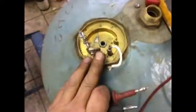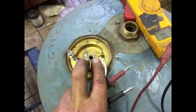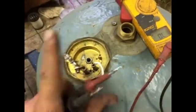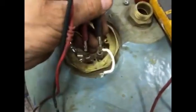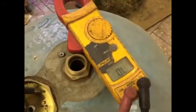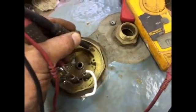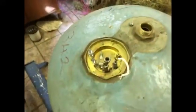We're actually getting 17 ohms, so we're checking to make sure there's continuity down there. If you haven't got continuity, that's one of the checks to confirm the element has failed. The other thing to check is between each of the terminals and earth - if there's a reading there, it means there's a hole in the element and it's letting power flow through the water from the live through the water to the earth. So that's diagnosing it - you're checking that you have continuity through the element, the stat is working, and you've got power to it.